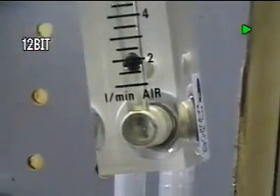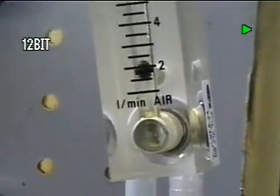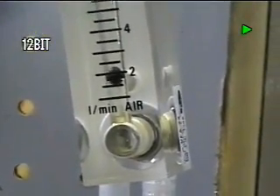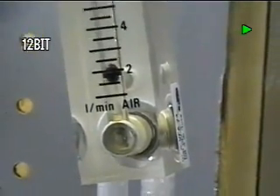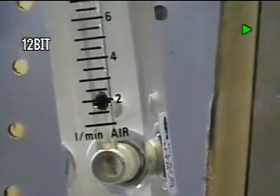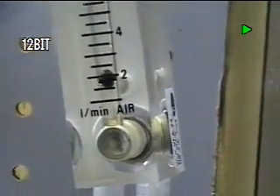That's now at 5 amps because we cold-started at 3. Now when it's done warming up, it will end up running somewhere around 8 amps. At 8 amps and 13 volts, that outbound gas will go from where it was at 3, now up to 5, and when it warms up to the 8-amp level — because making hydrogen is exothermic — when it gets going there, it'll be up around 2 and a half liters a minute.